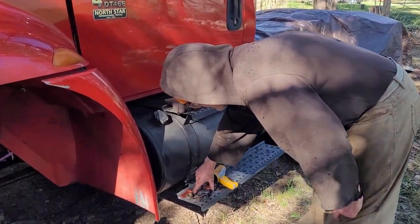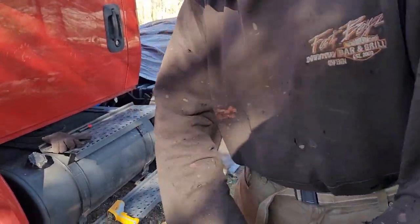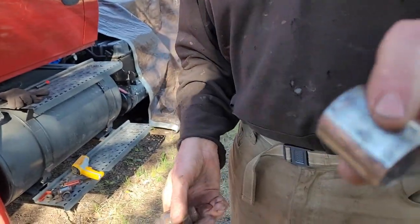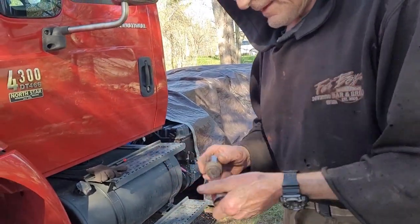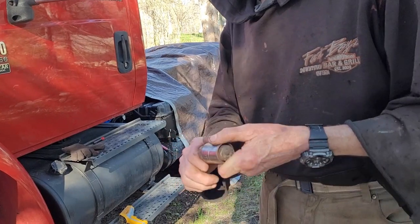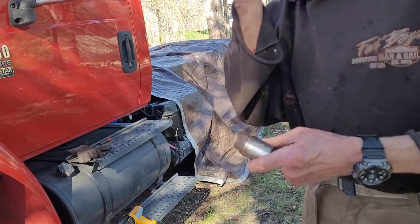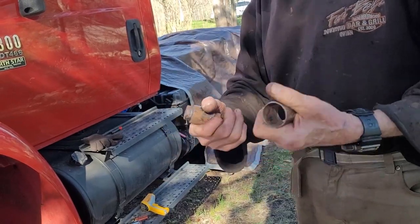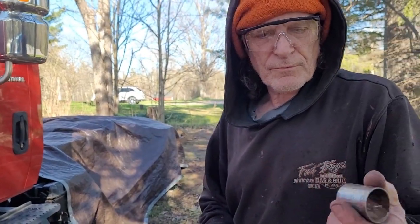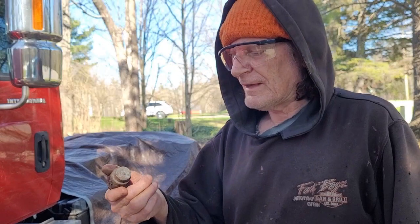These are actually, can't even touch that. I wouldn't. Here, you can see these are two different parts. You have a chrome plated spring that goes in there, and then your pin goes inside that spring. Spring has a split down the side. You can see it's supposed to just come loose because that's chrome or stainless, one or the other. But this pin, since it's not stainless, it rusts and becomes a solid piece of whatever it's in.